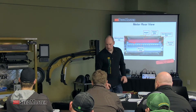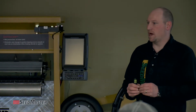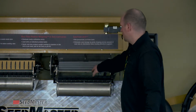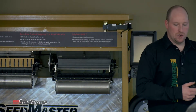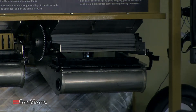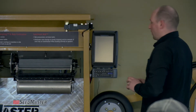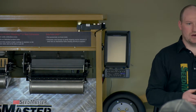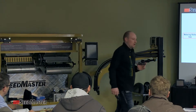Typically how I adjust the gap: with a grey roller you're setting the gap to 1/8 inch. We always need to make sure we get the right gap for that roller. When setting it to 1/8, make sure the largest part of the roller diameter is right in line with the metering ledge. I use a 1/8-inch ruler square — I lay it in the tray along the metering ledge, then gap the roller evenly left to right using two 9/16 wrenches to loosen the bolts.